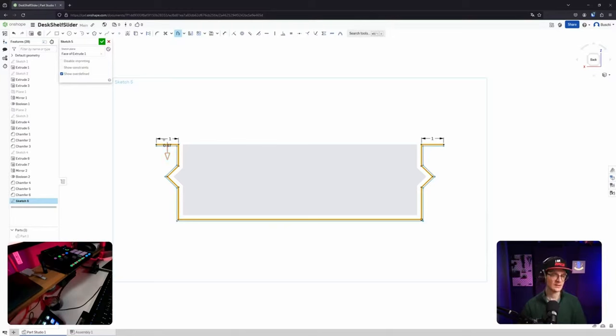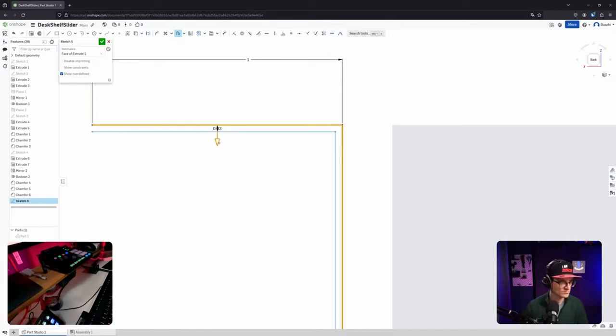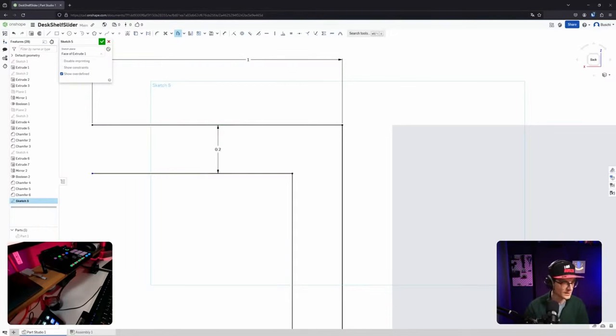I need to do this actually twice. I need to get this offset away from the box itself to give it a little bit of spacing, and then I need to, of course, define the shape and the thickness of the wall of the shell, right? So the offset would be something like, usually I go with 0.3 millimeters. I think in this case, because it's also on both sides, it's probably fine. Maybe 0.2 actually.